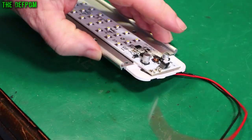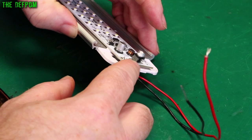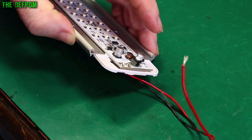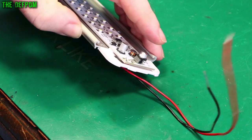Let's pull this switch apart. These switches can be dismantled — they've got a little edge on the side. You can see this little finger which holds it on, a little latch. There's one of those on each side. We could unlatch the switch, take it apart and see if we can clean it. Maybe it's got some burnt contacts because I think it's underrated.